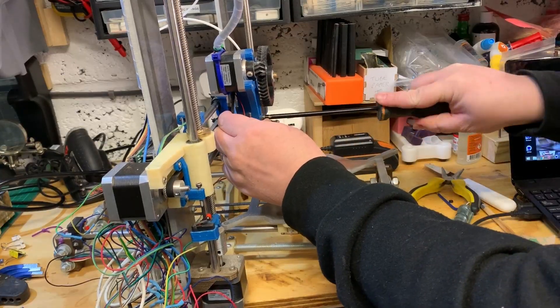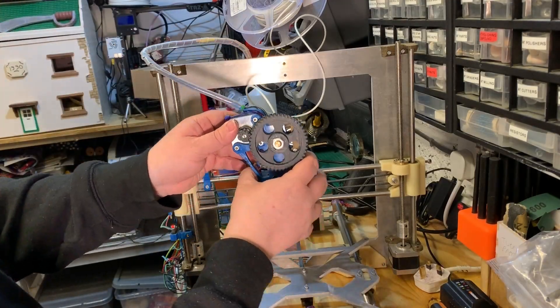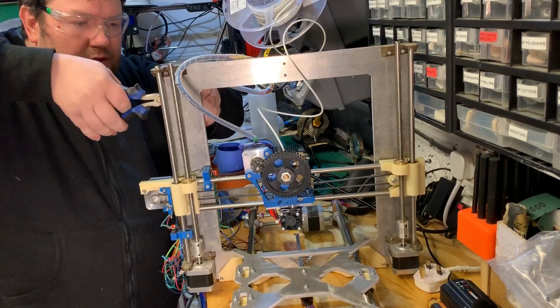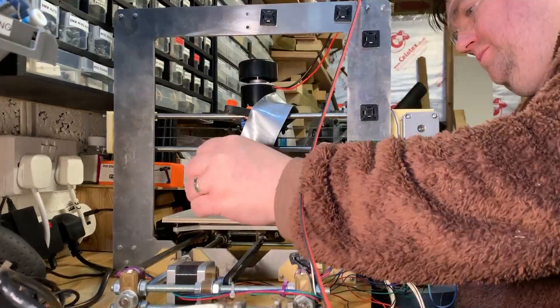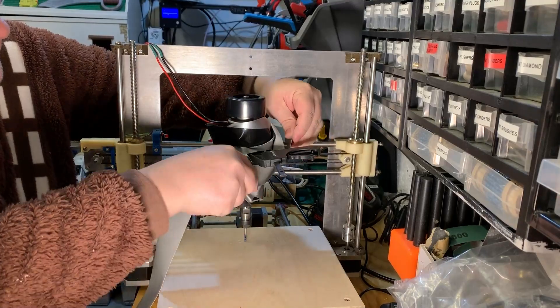The extruder also had to be removed, as well as all the associated wiring like the heater cables and the temperature probes, which made things a little bit easier to deal with now with the wiring. The Banggood spindle comes with a nice mounting bracket which means I just need to drill a few extra holes in the existing mounting plate. But I'm impatient and a bodger, so I used some gorilla tape to make a temporary mounting. There! Looks proper good that!